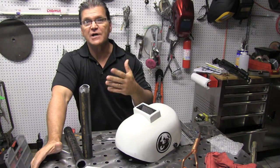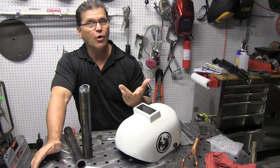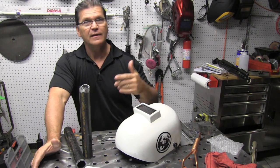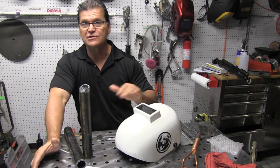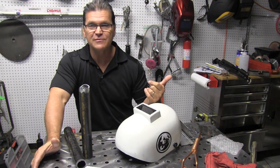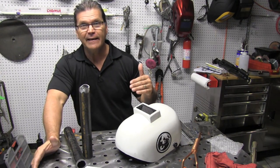It's a big topic because there's hot rolled steel which needs to really be prepped down to clean bright metal. There's cold rolled steel which you could probably oftentimes just weld as is. There's stainless and aluminum — oftentimes welded without doing anything, maybe just a solvent wipe. But for certain applications like taking an aerospace welding test, you'd go a step further and use more stringent cleaning practices.